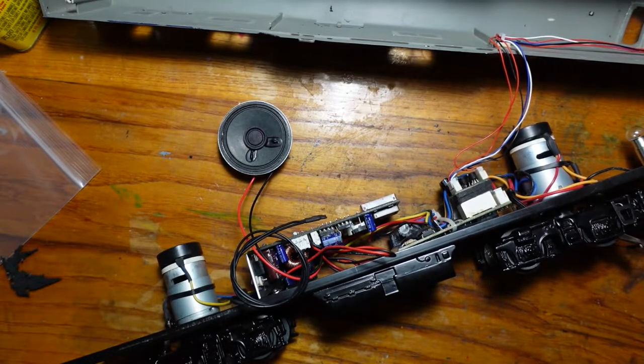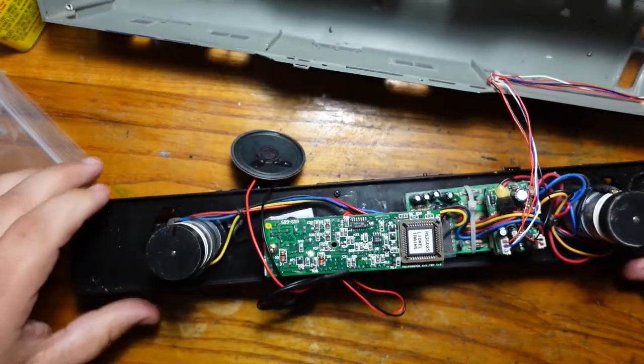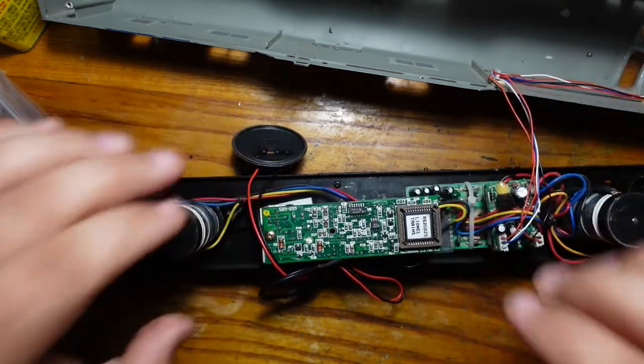The reason I put that adhesive square is to create insulation between the board and the frame, just in case we got a short or something. Short runs through the frame, and I don't want these transistors shorting out. So just to be safe. That's installed — nice and clean. This can move side to side just for positioning.